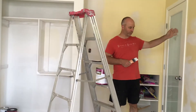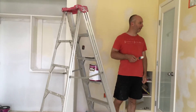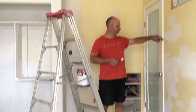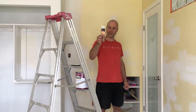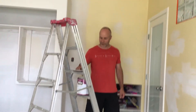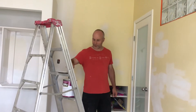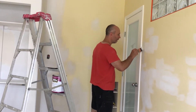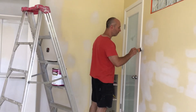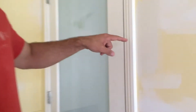How I like doing rooms — a lot of people put tape around the ceilings and floors to tape off the areas they want to paint. I've found that even with the best tape, it often goes behind the tape and gives not the greatest look. I just use a small brush like this, get it fairly wet, load it up fairly good, and just go like this along the edge doing my cut line. If you come over here, you'll see this is done — no need to tape, way faster. I'll do this all the way around the edges and then do the main area with a roller.